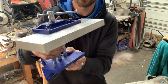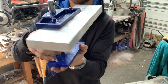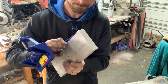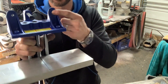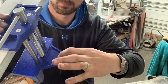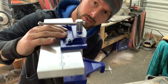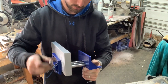That is the general idea and it worked well — there's enough bite to where those plates are in there really good. Those quarter-20 bolts worked fine for this size. I'm going to do the same thing with the other one. I need to run to the store to grab a couple more bolts, and I'll also need a couple of lag bolts. I'm going to drill a hole right here in this flat area to get one more bolt through the table — three bolts total to hold it to the table nice and secure.